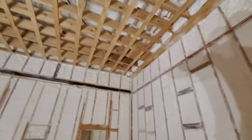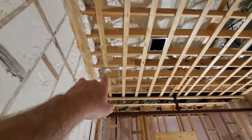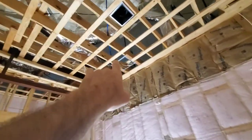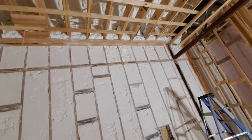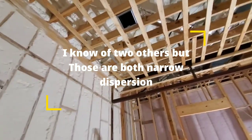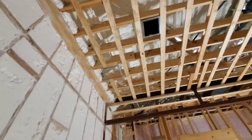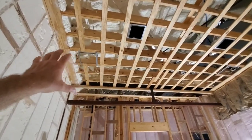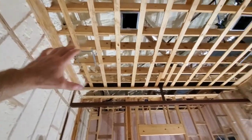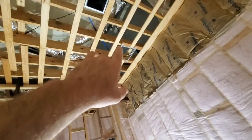The same thing up there for the top fronts — those are also in-room speakers so we're not doing in-ceiling speakers up there. We're actually going to be able to aim those perfectly. For top middle we've got the Triad Nine Sat — you can see the construction brackets already up there. It's a very large speaker, one of the only ones anywhere near its price range with a true 45-degree angle. We're not putting some 20-degree angle speaker up there relying on off-axis response — we can actually angle it 45 degrees and get true on-axis sound. They're also truly wide dispersion, so we're going to have fantastic sound from the top middles. You're not going to hear any timbre difference as objects pan across the ceiling.